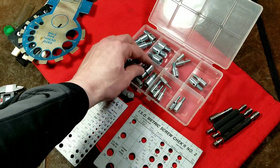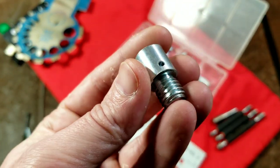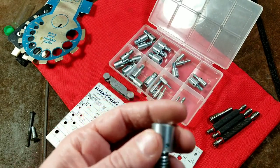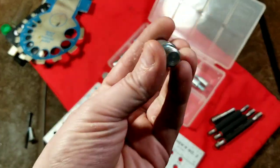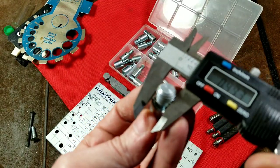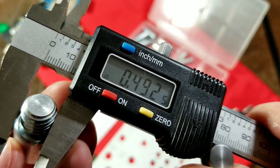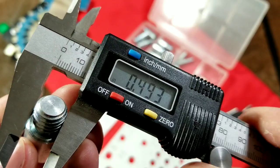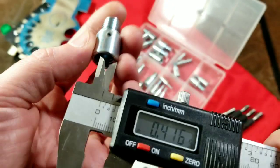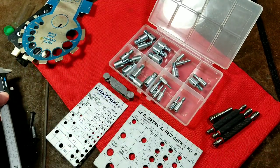Just to get back to that sizing thing — these are just quick and easy to use thread checkers. Many times these come on a big long cable, but I pulled this off. We can see this is a half inch 13 unit. If we measure across the threads, we're going to get just about a half inch — it's a little bit small because it's a checker, so it's supposed to go into most threaded holes. But if we measure the hole on the back, we can see it's a lot smaller. So that's the one thing to remember: the hole is what's small, not the outer diameter of the fastener.